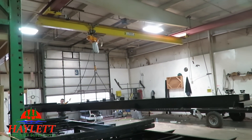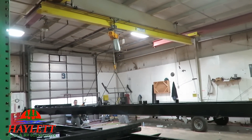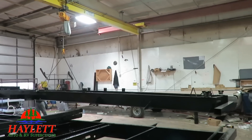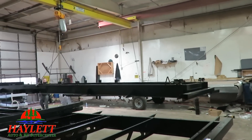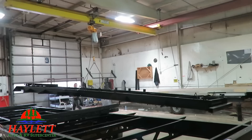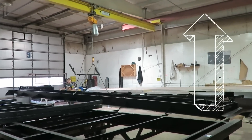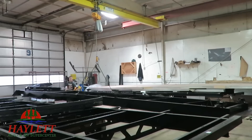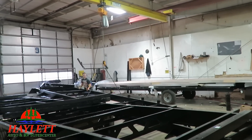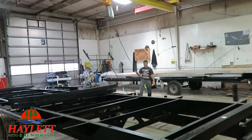Like almost any travel trailer, this all begins with just the bare chassis. They come in all stacked up. What you're seeing here is the fellas using that handy little crane to move them around individually. The jacks are actually already installed, and it's actually facing belly up right now. They're shipped belly up so that they're ready and in position to simply attach the axles, the tires, all the running gear — because it's much, much easier to do that from the top down than the bottom up.